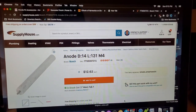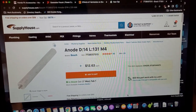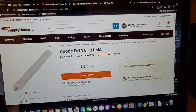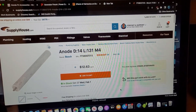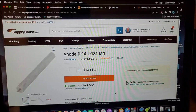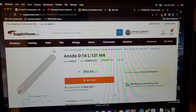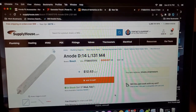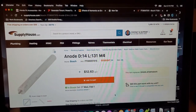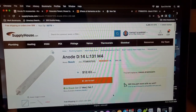I'll send the link in the description below. This is the anode rod replacement — it's $12.63 at the time of recording this video, plus shipping, which would probably be about $7 or $8. You could get a couple of these and keep them on hand so that when you flush out the tank once a year you can inspect it, make sure it's not too overly corroded, and simply replace it. Hopefully that should prevent this failing within six years. I got lucky, to be honest — I'm surprised this thing didn't fail sooner. But I'll take it and learn from the mistake.